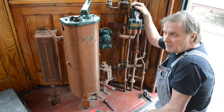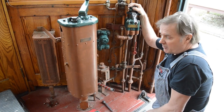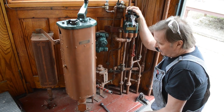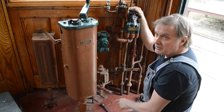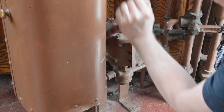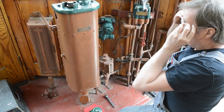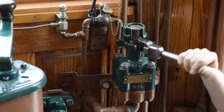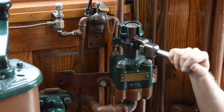The car is live — we're working on it live with air pressure on it — so we want to cut out the supply to the feed valve. Sometimes these older valves, and this car is 103 years old, are a little stiff, so we put a short hunk of conduit here just so we can cut the valve off. Our next step is to bleed the air off the feed valve itself.